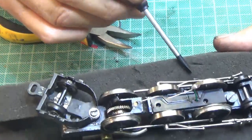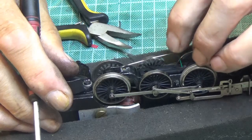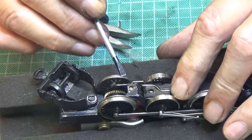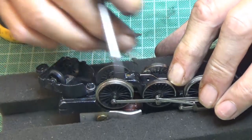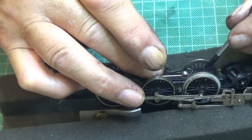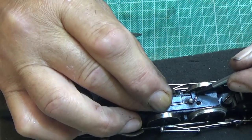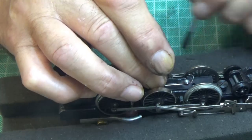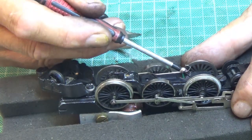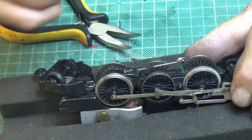On the base here, there is a groove for the wire contact. The side here is okay. It sits neatly in there and it's fed behind this drive wheel, just in there. When I look at the other end, the groove comes down and goes along to the front of this wheel. But this doesn't reach. And because it's been bent, I'm thinking that perhaps this is broken. And someone has twisted this to try and make contact with this rim.